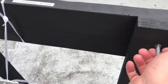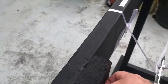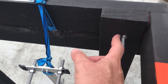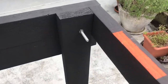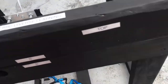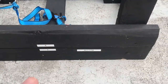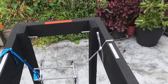For ease of storage I've made it using these bolts here — the cheapest galvanised bolts I could buy rather than stainless steel. Ideally you'd put a washer underneath as well, because the timber is quite soft and over time the nut is going to eat into it, but improvements can happen later. I tried to drill the holes for these bolts in the same spot so that when you disassemble it, it will go back together easily and remain reasonably flat. The tops are just a rectangular frame.